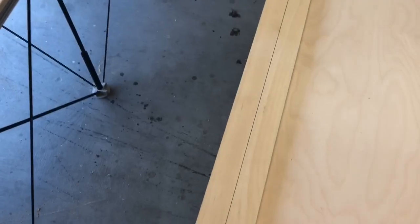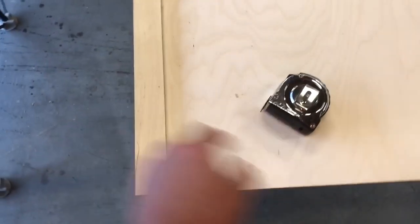So as you can see, these strips are gonna get glued to either side. Obviously there's 4 of them because we're doing 2 tables. And then you need the 2 side rails and then 1 more on the bottom on one side for 3 layers on one side to add that track. So I rip these at 1.5 inches.